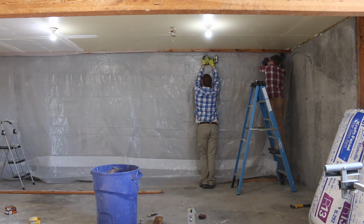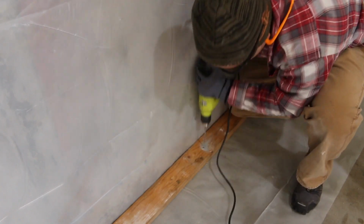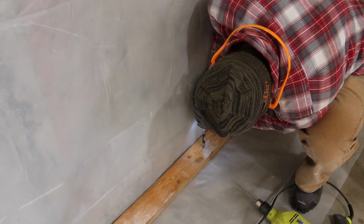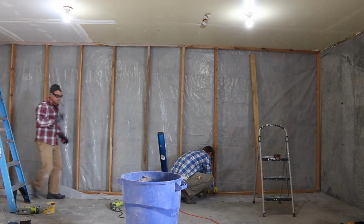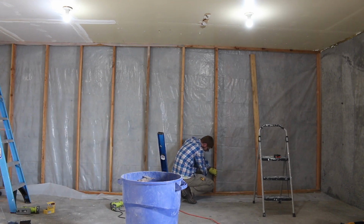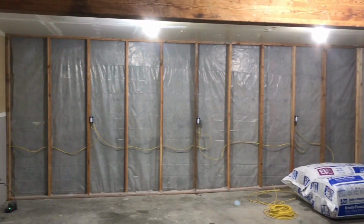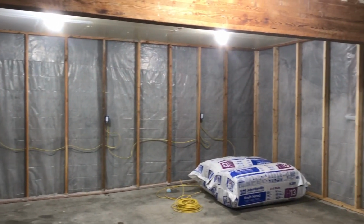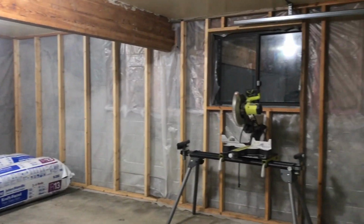Now, the floor slants toward the center of the garage, and so things weren't perfectly square, and so we stick framed the walls. The bottom pressure-treated boards were secured by pre-drilling into the concrete and attaching with Tapcon screws. We spaced the boards 24 inches on center and worked our way around the two sides of the garage where the concrete was exposed. Then the outlets were wired, so there's going to be plenty of power and outlets available. Then it was time to add the insulation.